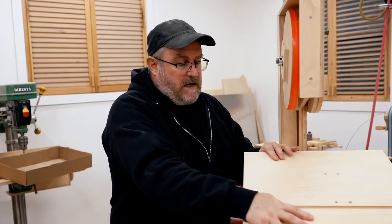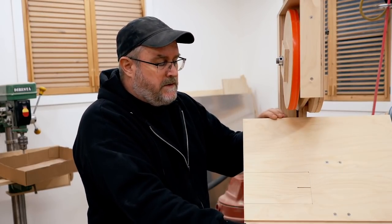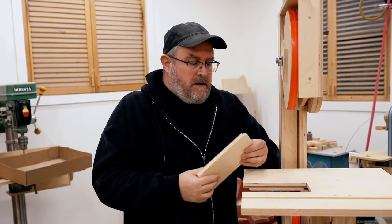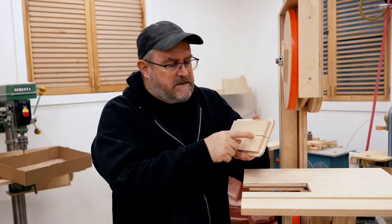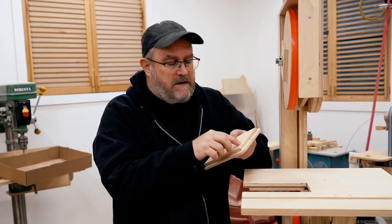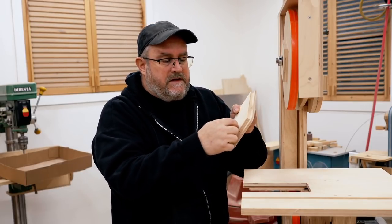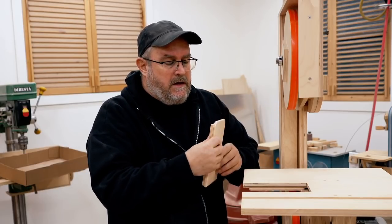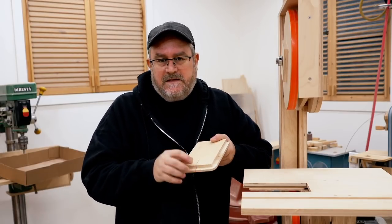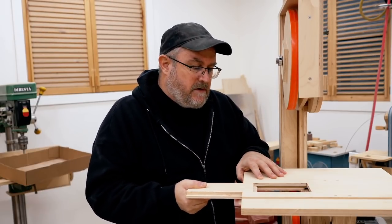The table and trunnion — let me loosen it a little bit so you can see that it tilts up 45 degrees and tilts back down. What I'm thinking I'll also do is cut this area out right here, rabbet it in about an eighth of an inch, and put an aluminum insert right in here. It's thinner, and when you tilt the blade it's going to come out roughly in the same spot on top but it'll be cutting through all this part here. I'd have to tilt the thing and slide it in to cut that out, and it doesn't leave a lot of strength for the wood on that cutout, whereas aluminum will be good for a very long time.